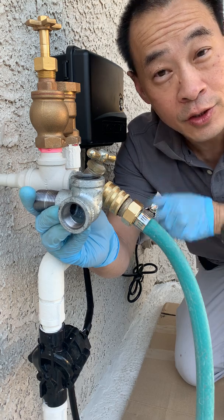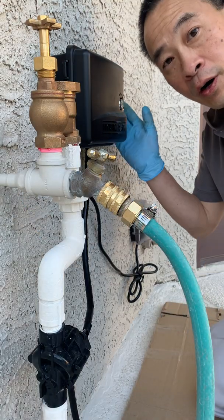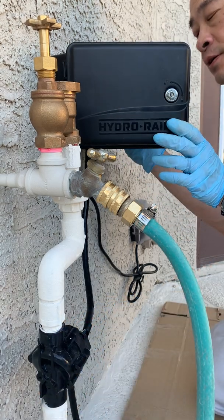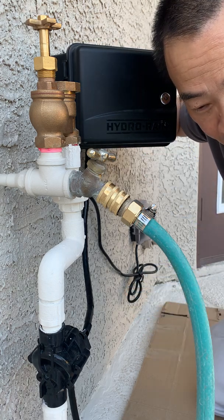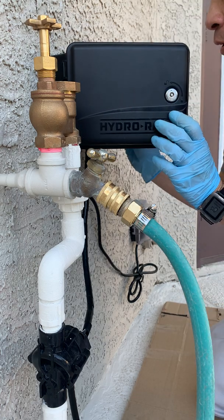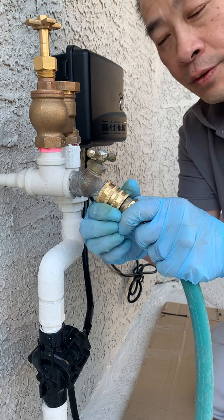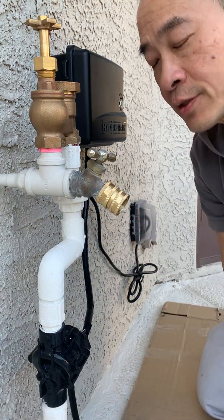So let's go shut the water off. The water is now off and we're going to depressurize the system by turning this valve on again using the sprinkler timer, then turning it off. The system is now depressurized. We'll unhook the hose and work over a piece of cardboard to keep everything nice and clean.